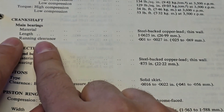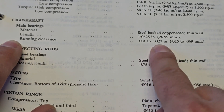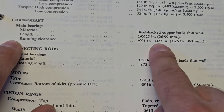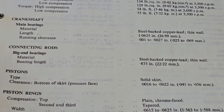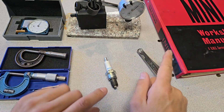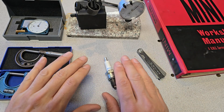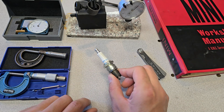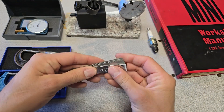Another example is the crankshaft running clearance: 1.0 to 2.7 thousandths of an inch — again, a range specified by the manual. Now that you've seen what the manual says about measurements, let's talk about how to actually take a measurement and what measurements are, before getting to setting a spark plug gap with the feeler gauge.